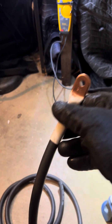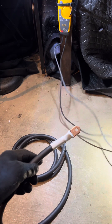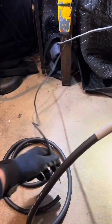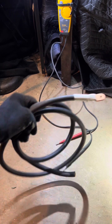From here, just make sure you actually have a connection. You definitely do, but it doesn't hurt to meter it out. Put it on ohms, and it doesn't matter where you put it as long as it beeps. All right, you got a clear pass — that's good. And that's how you install a lug terminal on a heavy duty cable. Thanks for watching, see you next time.